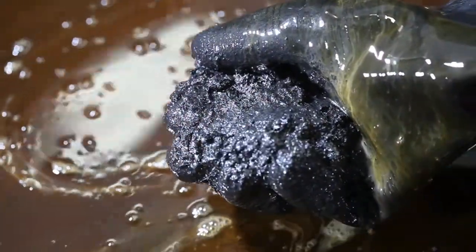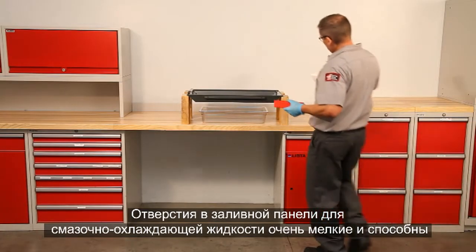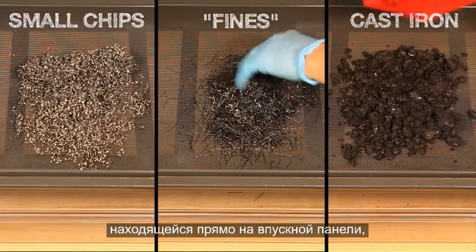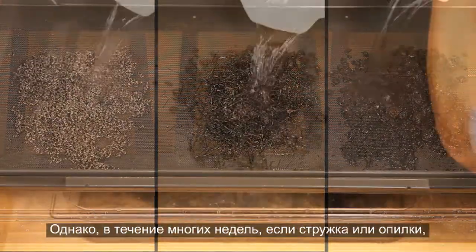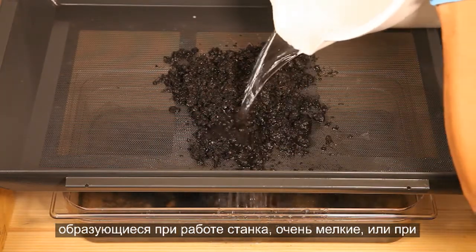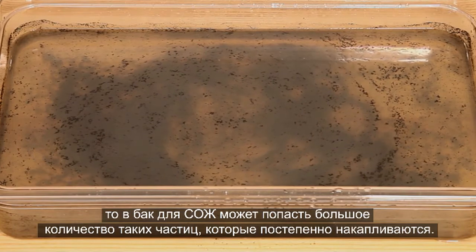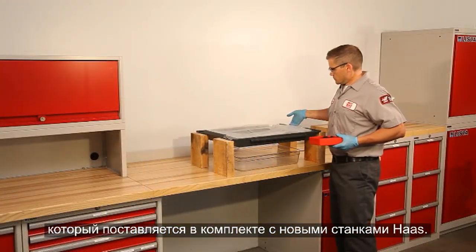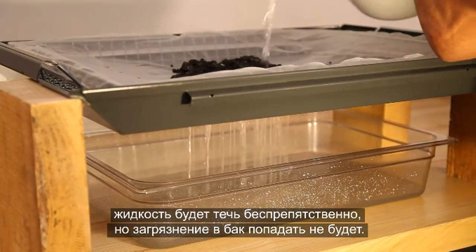Sometimes, really fine chips or sediment-like contamination can reach your tank. Let's take a closer look at how the coolant inlet panel works and when you need to consider using a chip strainer. The perforations on the coolant inlet panel are very small and do an excellent job of retaining even fine chips. Even with a pile of fines sitting directly over the inlet area with coolant passing over them, only a small fraction of chips make it into the pan. Despite this, over many weeks, if the chips on your machine are extremely small or you are machining something like cast iron where the chips form a grit-like substance, a larger quantity can gradually build up in your coolant tank. In this case, you should consider using a chip strainer like the ones that come with your new Haas machine — stretched over the supplied chip basket and placed above the inlet panel, it allows coolant to pass through while keeping chips from entering the tank.